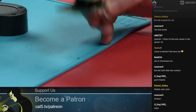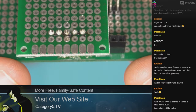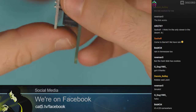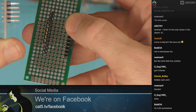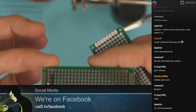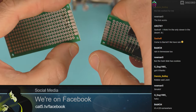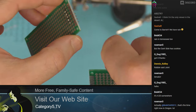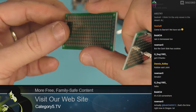Final joint — heating it up for just a couple of seconds and lift. Now I'm going to get in here and show you the joints. There we go — closer, focus. Nice. So you do have some really good contacts. These ones I've not soldered — these are just standoffs for support. Now when I lift this off, my headers are perfectly attached to this PCB. This is a great little tool to create and use. No flux was necessary in this particular case — though I might have wanted some flux because I got a little bit hot on one joint. As long as you're careful you should be okay.